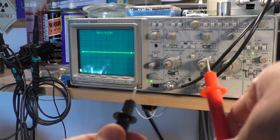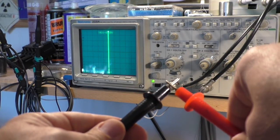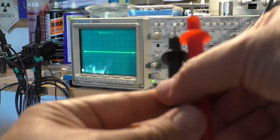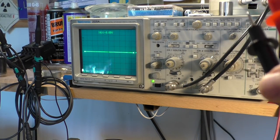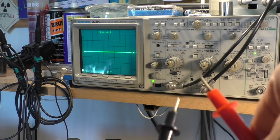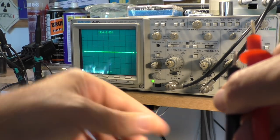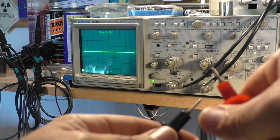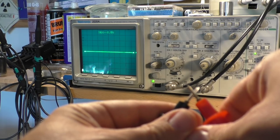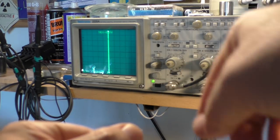Under normal conditions we have a horizontal line, and if I touch the two and make a short circuit, I get a vertical line. So what the octopus, or I have an electronic version of that tester, does is we have a voltage which is measured by the X axis here. When the circuit is open, and the voltage drops and the current rises when I make a short circuit. So we have the current on the vertical axis here,